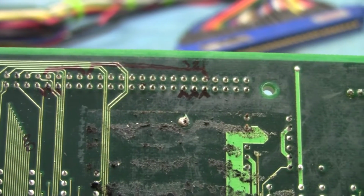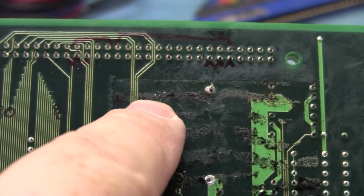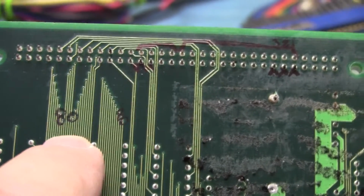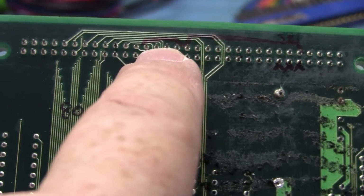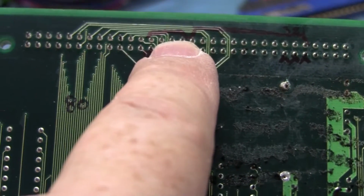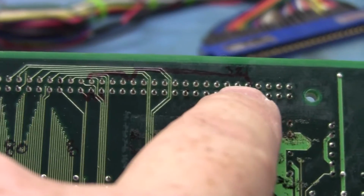Alright, so we're looking at the bottom side of where the battery goes. You can see the positive terminal here, the negative terminal up here. We've got the connector right next to it where all those traces run from around that battery. And then down here we've got the traces that map to those. So the 4 up here go to this end, and these are for the address bus. These, I'm sorry, the data bus. These go down to the LS245s. They could be AS245s or ALS245s depending on the board. Then these 12 are the remaining lower 12 data bus bits.